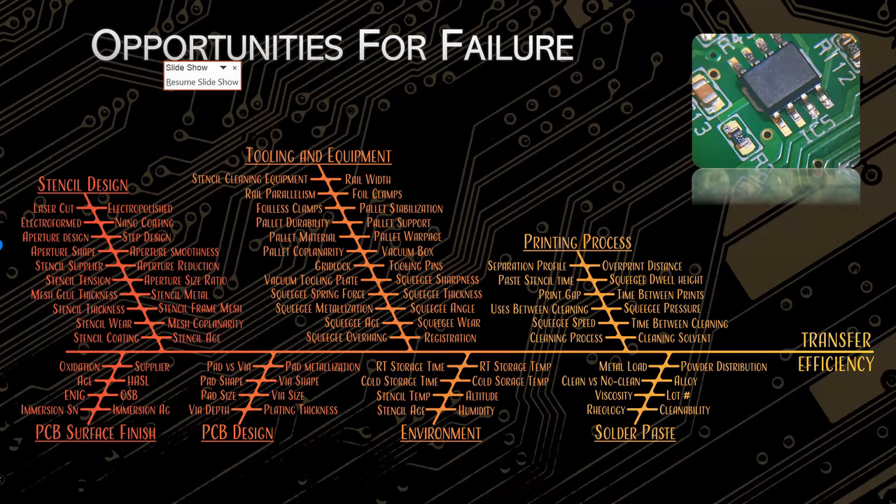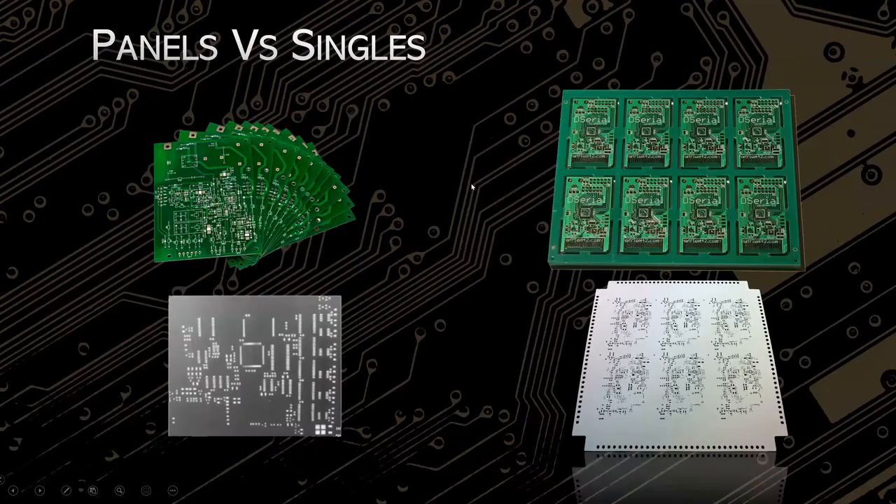Sebastian, can you share some of the other issues? Looking at the picture — you can actually see an example of horrible paste application. Those two leads the mouse is pointing at basically have no solder. It might make an electrical connection, but if that board gets bumped or vibrated, it could very easily lose connection and cease to function. The solder process is extremely important. Stencils, while they've been around and it's a proven process, they do have their limitations, and if there's a failure in the stencil process it almost always means you have to get a whole new stencil, add more turn time, and add more cost.